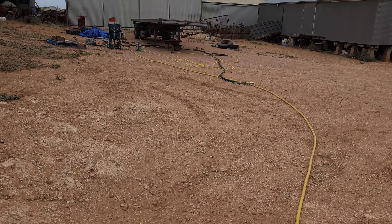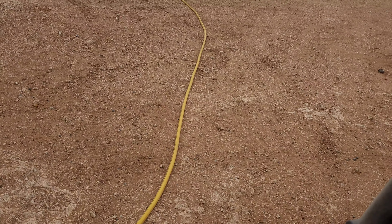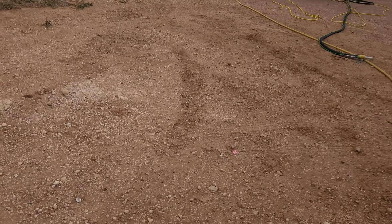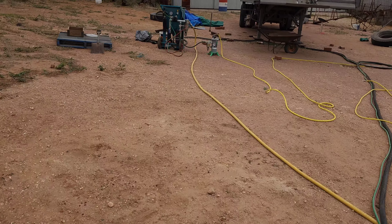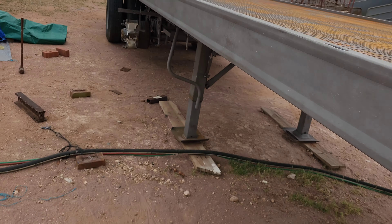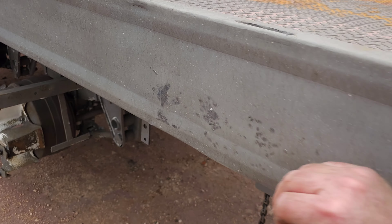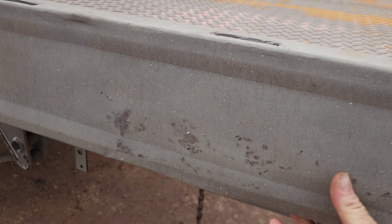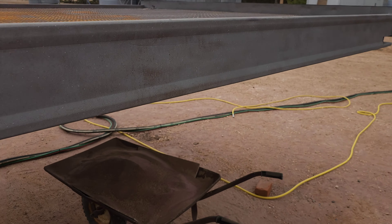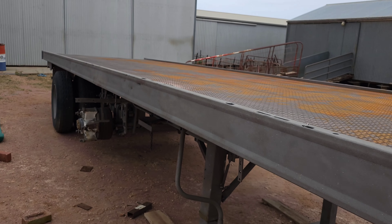We've had a good morning so far in as much as we had spots of rain which threatened progress, and I think there's going to be more coming. However, we've tidied up some of these cuts that were done on this magnificent trailer. We've also managed to finally straighten out this edge pretty well. They obviously had something run into it here but we pushed that out - now it's not as obvious. Taking the jacks away so we can hook on the semi and get it out of the weather. I'll try and finish sandblasting and see what we do from there.